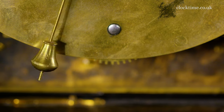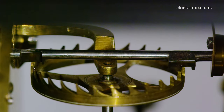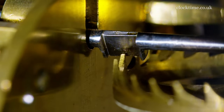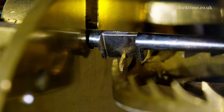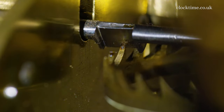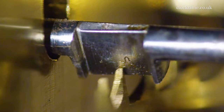And then the pendulum ticking away with the verge escapement behind. You can see the verge escapement now releasing one tooth after the other as each pallet releases and then catches the next tooth as it comes up. You can see the little impulse that the pallet receives to keep the pendulum swinging. Each time the tooth goes by it gives it a little flick to keep the pendulum swinging against the air resistance. I find it fascinating to see a verge operating in slow motion — how it catches and then releases each tooth, the pallet catching and releasing.